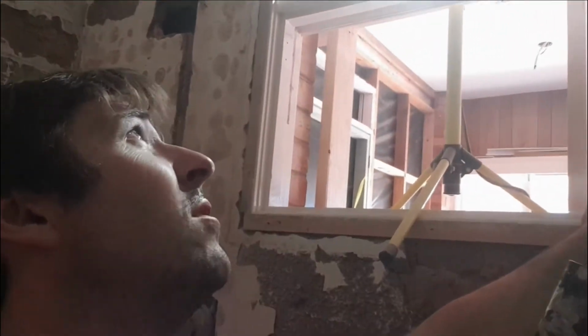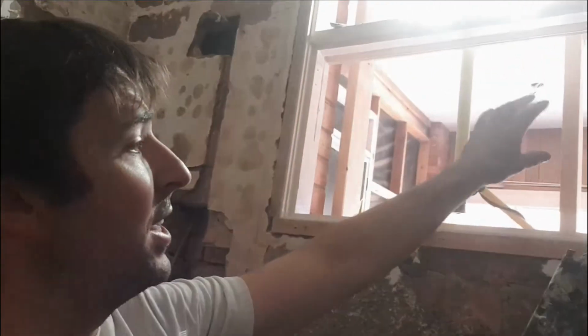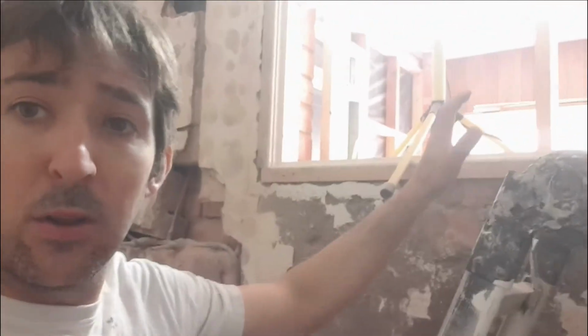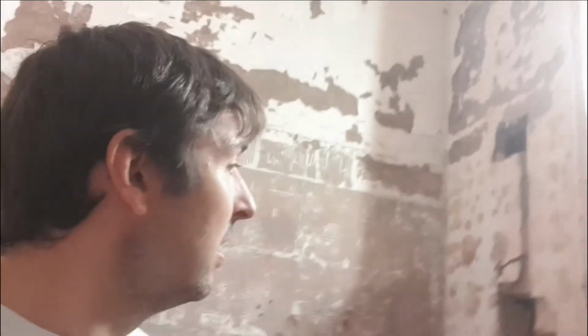So what we're going to do is get some wood together and box these windows in here. It has got a little bit of a step there already, which I should be able to use to our advantage. I'm going to make 2 box sections that go in the middle of the frame there. We'll push it in and leave enough step so there's still room for the concrete board to sit flush with the wood. Once we've got all the plumbing done and all the bricks back in the wall where we need them, we're going to give it a big render over with mortar so the wall becomes one before we chuck tiles on. So in saying that, let's go get some wood together and start cutting.